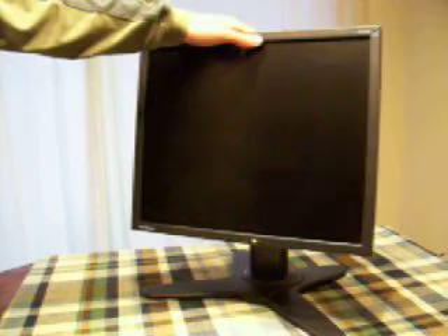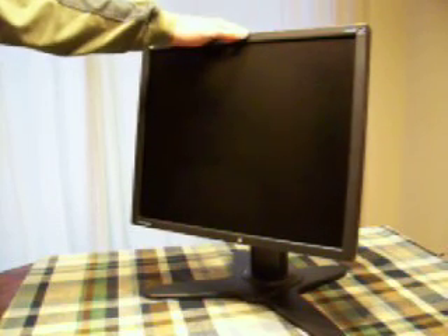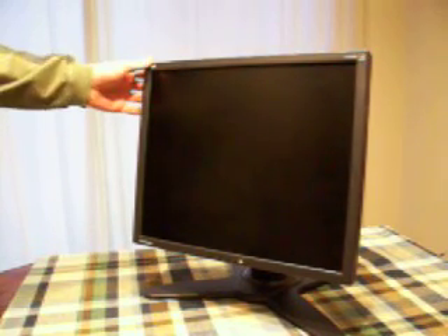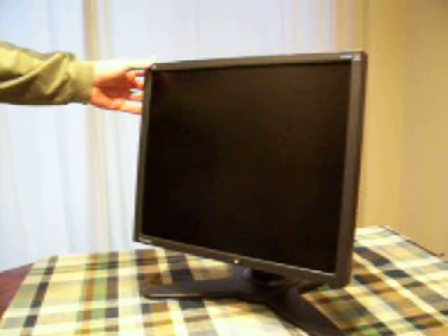I work in the industry, and it's always frustrating to see this sort of thing, where somebody in the company decided to save literally two or three cents by sourcing components from a manufacturer that is not reputable. This is what we all have to put up with because of those decisions. But if you have one of these monitors, it's really a 15-minute fix and you're back up and running again. If you have a similar model, it's probably constructed similarly and it's usually going to be those capacitors that wear out. In any case, thanks for watching, and I hope this helps.